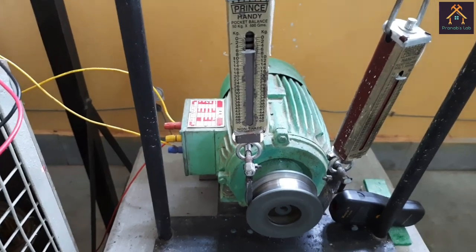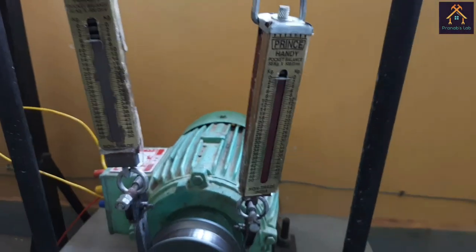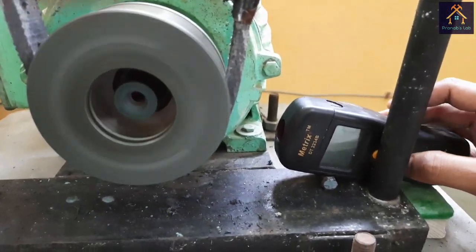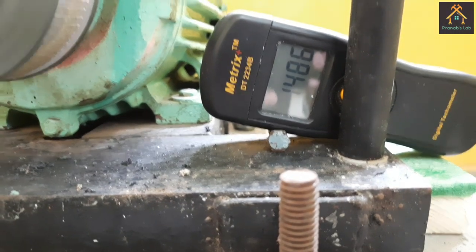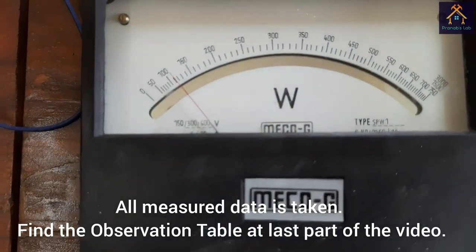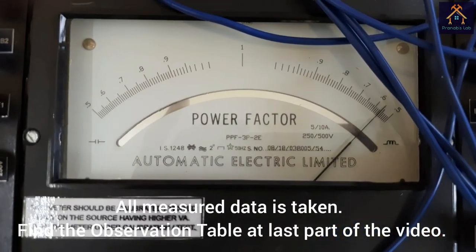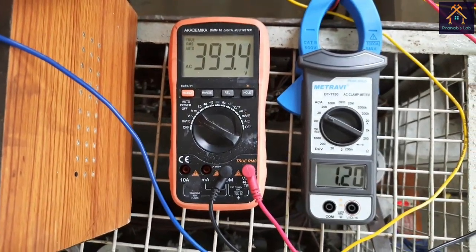We will apply some more load and you can see the speed is now decreasing. You can see the load is about 6 kg, and in this situation the speed is about 1486 rpm. The first wattmeter reading is 0 and the second wattmeter reading is about 110 × 4, that means 440 watt. The power factor is now improved and this value is about 0.56, and the voltage is 393.4 volt